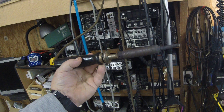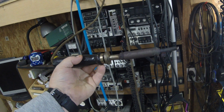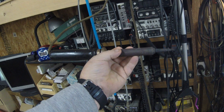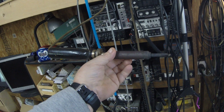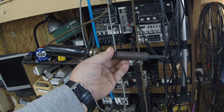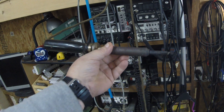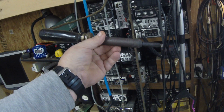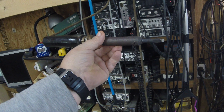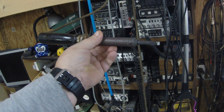We'll start with my Big Bertha here — I call her Big Bertha. This is a 120 watt iron, and the main thing about it is this huge heating element — it retains a lot of heat. For really heavy soldering, a perfect example would be trying to set a tab on a ground plane on a circuit board, or tin some wires down on a heavy block. This is the heavy duty guy. You're not going to be doing any pencil soldering with this, but to wire some 8 gauge and solder it into a connector, this is the one you want — it can distribute enough heat to fully melt the solder.